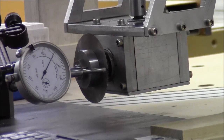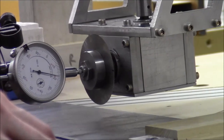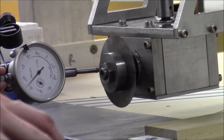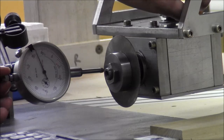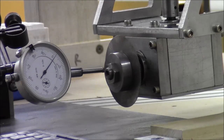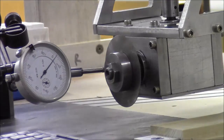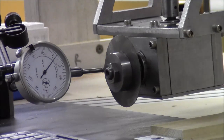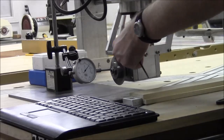So you can see the gauge here on zero, and I'm going to move the axis this way, pulling this away, sliding over. I want to make sure I measure off that same spot on the blade just to eliminate the chance of any major runout — and you'll see like two thou over. That just means we're about two-and-a-half thousandths too far this way. So what we've got to do is push the axis that way — or bring this axis this way — by about two thou.